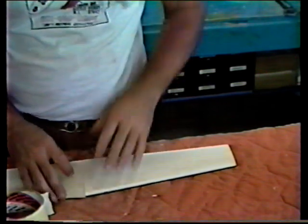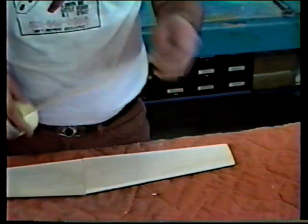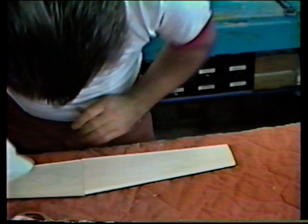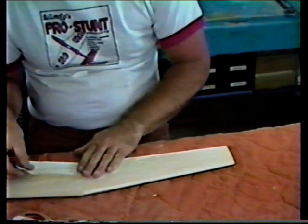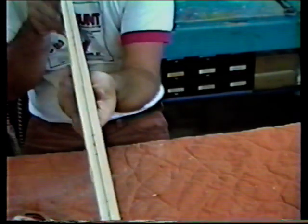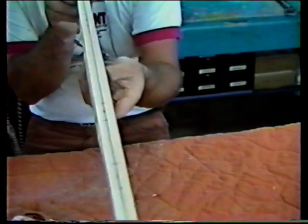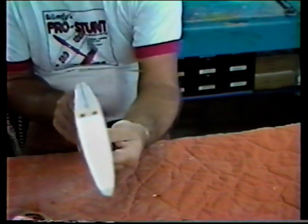Squeeze out the extra glue. Do the same thing. Tension the tail the other way now. So we're actually putting almost like a C-clamp on this. And we'll just keep stretching the side that's low until we get this where the center line is straight. Now we don't have it yet. I'm going to put a little more tape on this, get our alignment lined up in the center. Only look at the center line now. We can final sand in all the other edges.